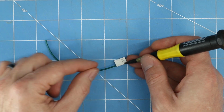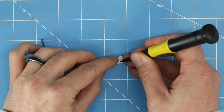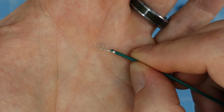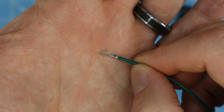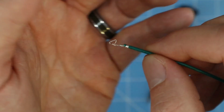So we are kind of actually pushing in the wire to press that piece with the awl, and it pulls right out. Again, you can see that finger's still sticking down, so you don't want to push down too hard with the awl, otherwise you'll yield that piece and it won't be really usable again.